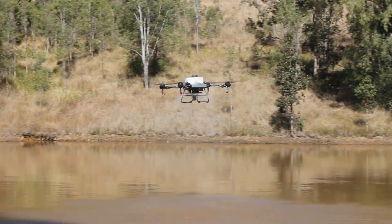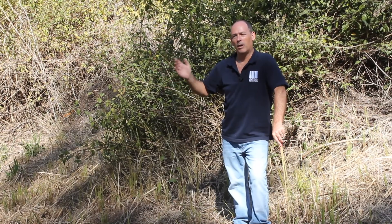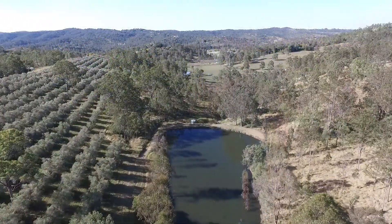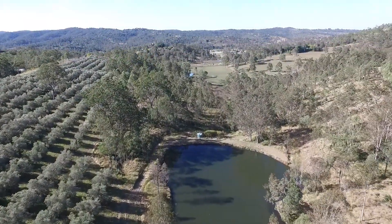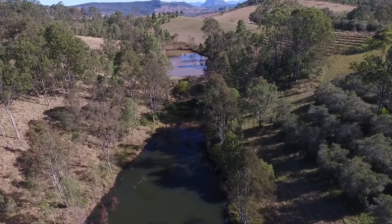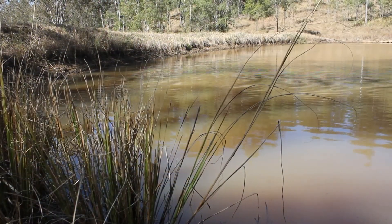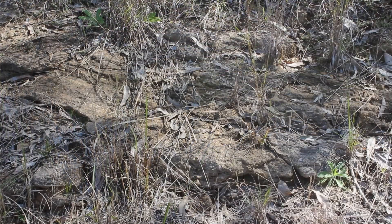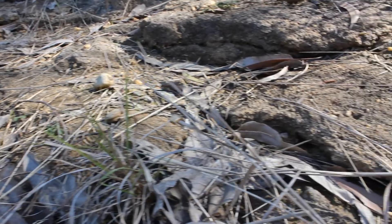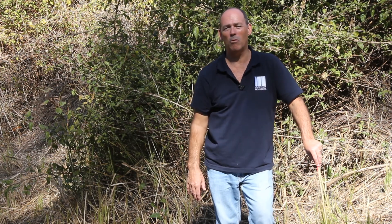In this catchment area we have a series of dams all the way down the hill. When we discussed this with the landowner, what we've decided to do is sort the problems with this dam first. This dam is further up the catchment and this leakage is feeding the bottom dam, so it's very difficult to tell exactly what's going on with the next dam — it's pretty much at full capacity. One thing we've spied on the side of the dam is some outcrops of sandstone. That tends to suggest there may be some very sandy, crumbly, rocky soil through the base, and perhaps even some sandstone seams, which are notorious for causing leaks.